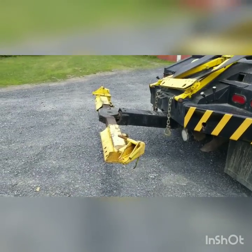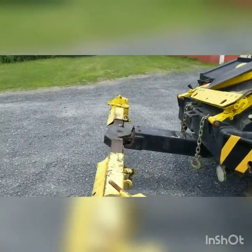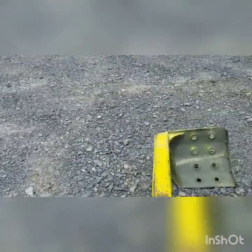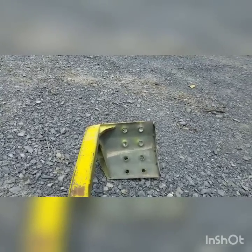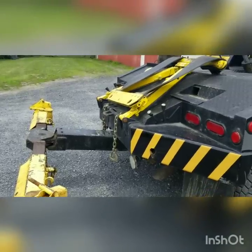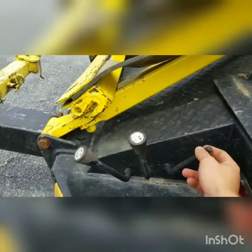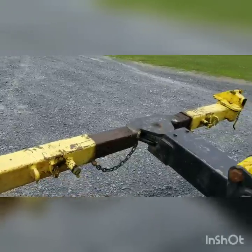The whole concept behind the Vulcan wheel lift is gravity. You depend on the weight of the vehicle to fall in place with this scoop. It's an odd-looking shape, but when the tire wedges itself in there, it's got no way to come out. What I also like about this system is where the controls are — up and down, tilt, and in and out — so I can better observe what's going on underneath the car.